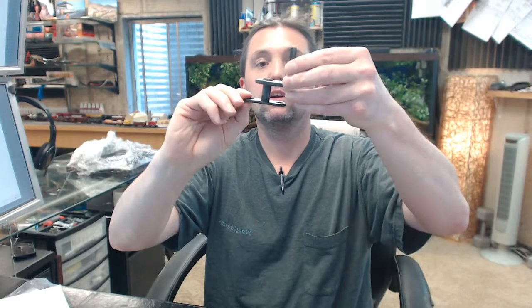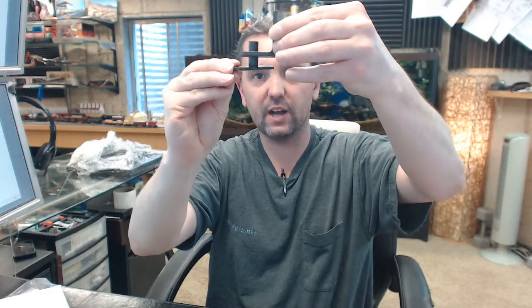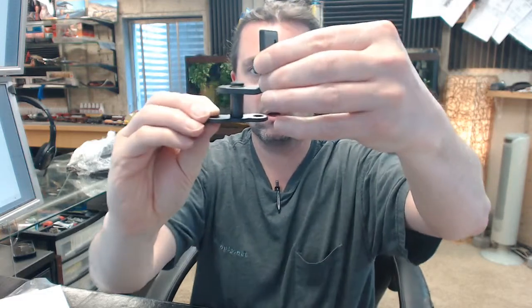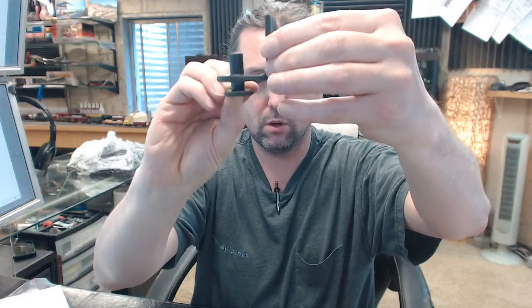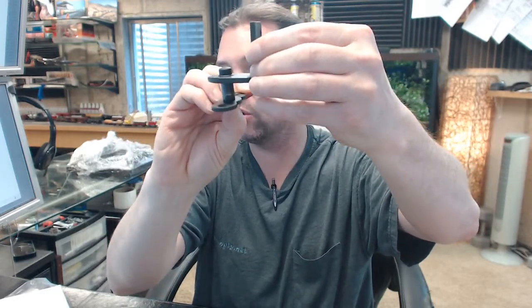Again, flush it off to the end. Step 4, fasten the top bracket, allowing clearance between the top bracket and the top pivot plate. What they're calling out there is 3/4 inch. And that's because you need that 3/4 inch right here, because when the door is opened, that plate actually does this. That's how it works. That's why you've got to have that 3/4 inch there.